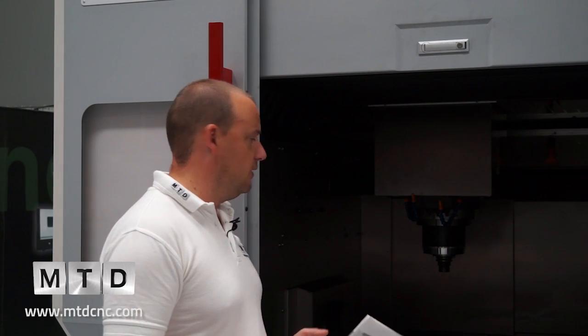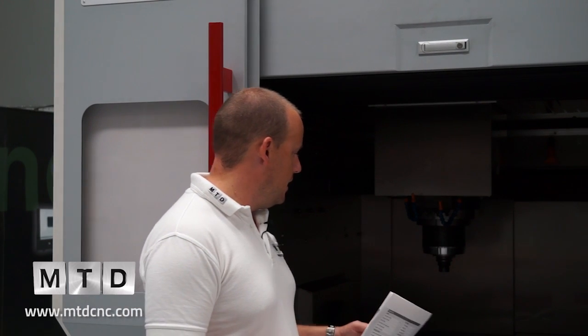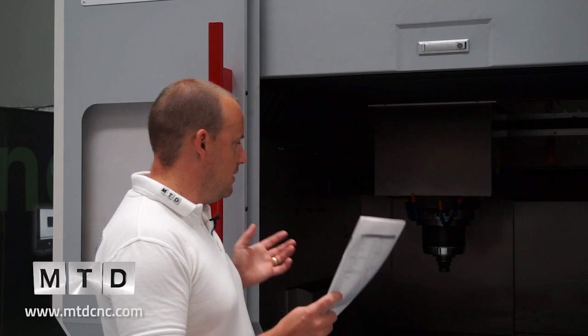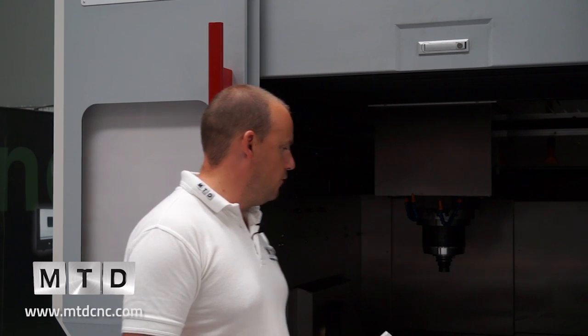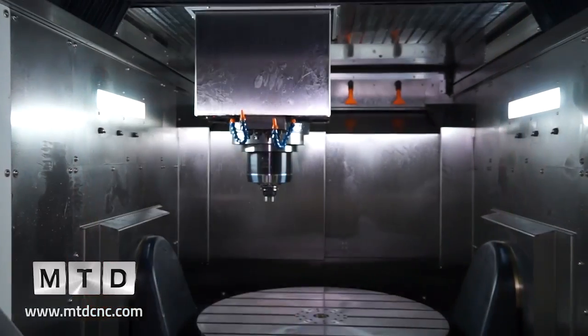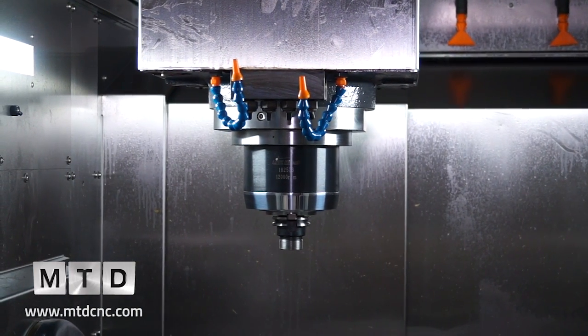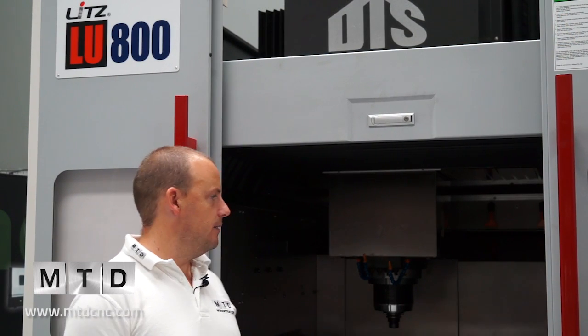One of the things I liked about the machine is the 900 millimetres in the Y axis. It's quite unusual to have a machine of this size with such a compact footprint, yet offering 900 millimetres in the Y axis — meaning you can potentially get a part that's a metre in depth on the machine. It's also very easy to load. The control can be moved on the arm and there's a hand wheel which you can use to go into the machine to set offsets and components. As you move into the machine, you can get right close to the table — a very effective build and design.